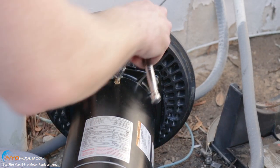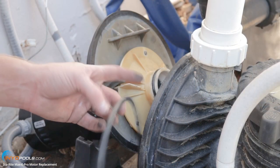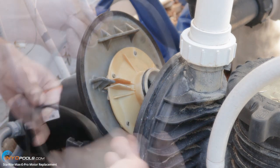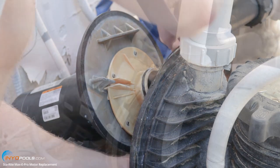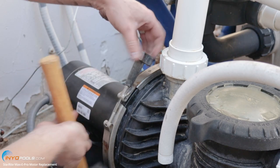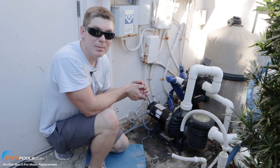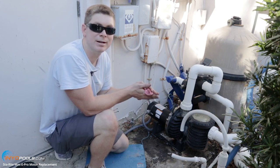The last part of wiring is the bonding wire — just reconnect that. Before we put the two pieces of the pump back together, we're going to replace the housing o-ring. Again, just use a little bit of silicone or Teflon lubricant, and there's a groove in the plate. We've got the clamp on — just tighten the knob, and as you tighten it you can tap it loosely with a rubber mallet to make sure you're getting good contact. We've got the motor installed. The only thing left is to prime the pump before you turn it on. If you have any questions about this video or anything pool related, leave a comment below or visit us at inyopools.com. Thanks for watching.